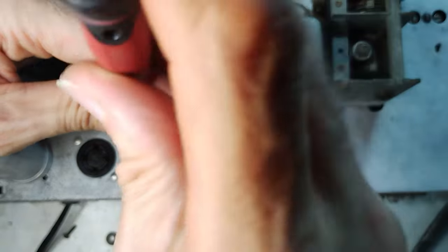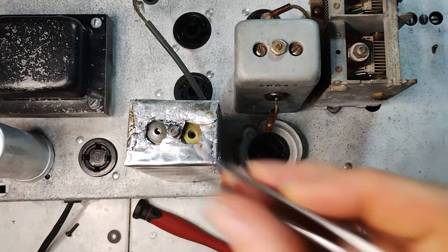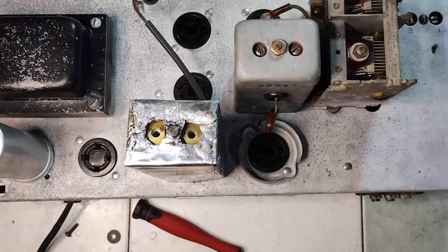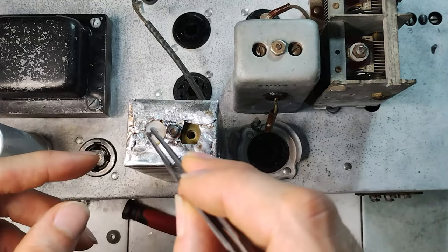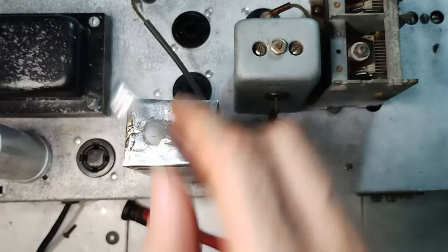On a homemade IF can, the insulation of the trimmer capacitors on top might be a serious issue. Therefore, the washers are replaced with nylon equivalents. But, because in this case the thread of the screws is metric, also nylon screws are used that would make the alignment procedure much safer.